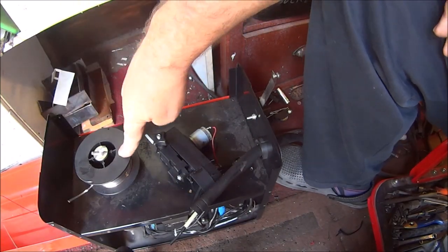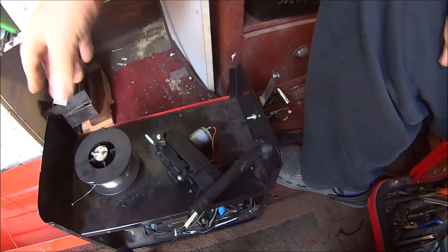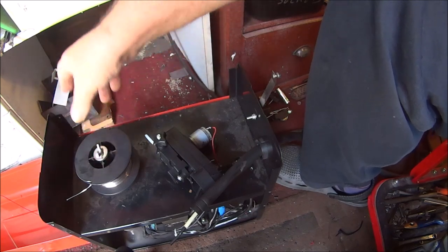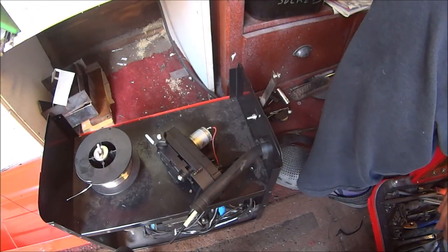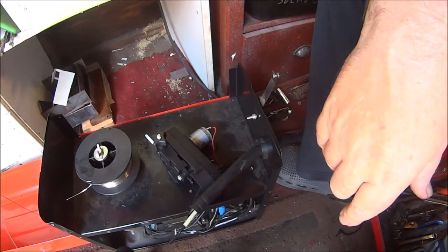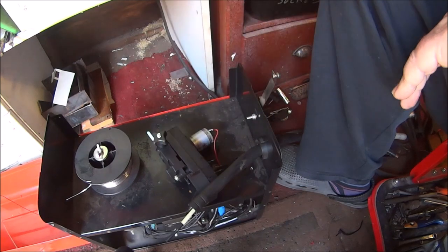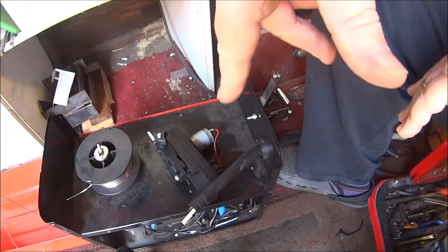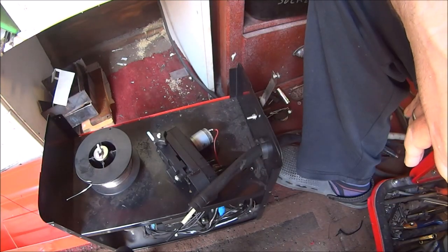Since this was new I think that's about the third or fourth spool of wire I've put onto this — because the other ones have run out. So just remember, if you've got a Sealy power welder — 100 quid or 80 quid or whatever it was — when you've used three or four spools up, you're going to have to buy a brand new wire feed gearbox unit, 20-odd quid, and go through all this to fit it. Then you'll use another three more spools and have to buy another wire feed unit. Yeah, lovely.